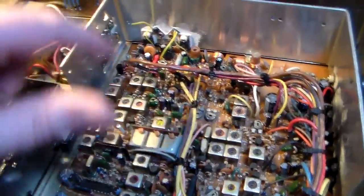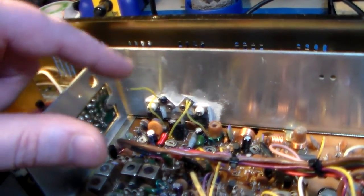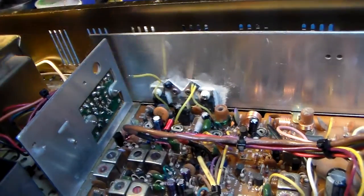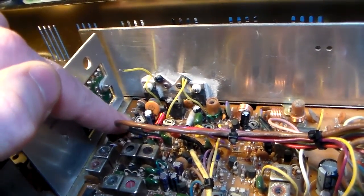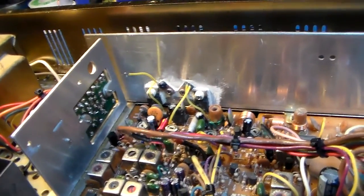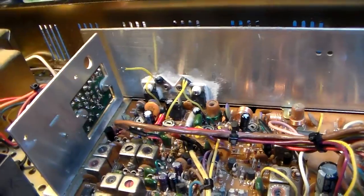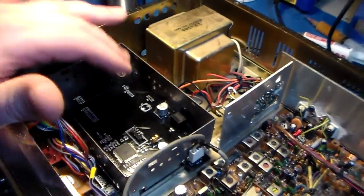I was working on this thing, just fixing some RF deck problems. Ran into the fact that one of these old MV1Y things is shorted. Got the bias just cranked all the way down just to try to avoid so much saturation of it. But yeah, I got to figure out what to do about that. Recapped it all, new caps. Got this mostly going. I gotta work out the buttons and all that.